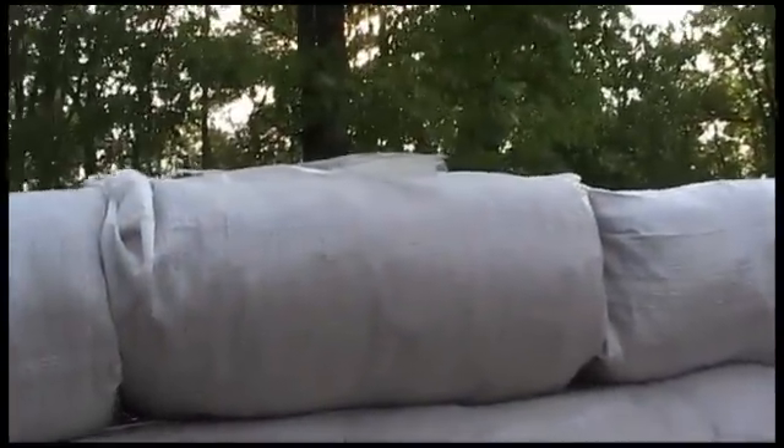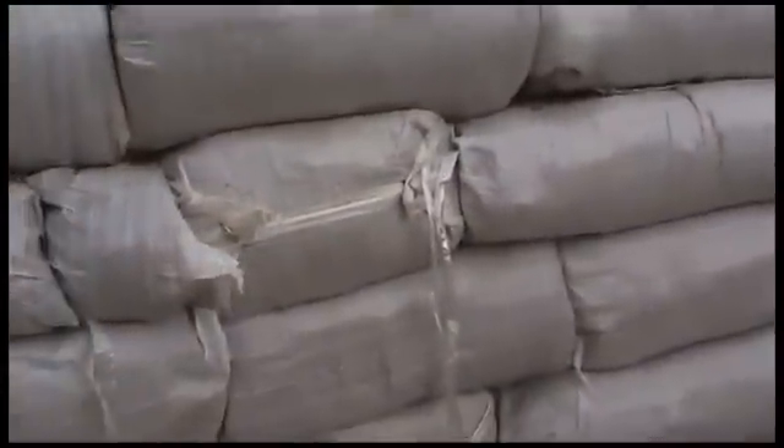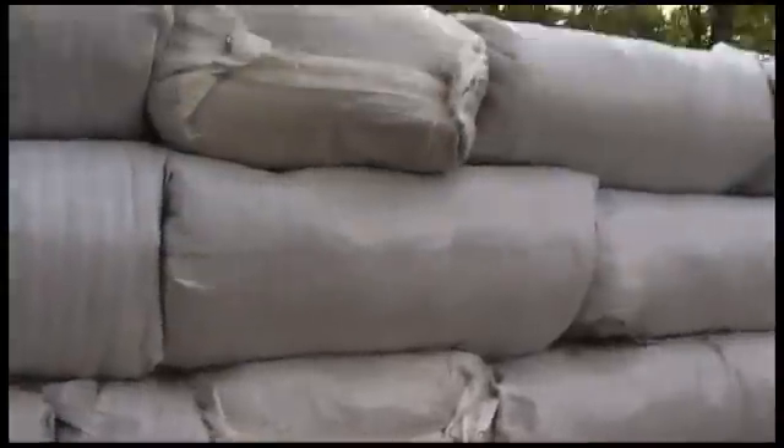These are polypropylene sacks filled with sand and clay that's moist, and then we pound the crap out of it. Between each row are two lines of barbed wire, and the barbed wire acts like velcro. If you've ever had barbed wire catch onto your clothes, you know what that's like. It does the same thing with the sacks, so when you're trying to get these sacks off it's actually pretty difficult — it gives tensile strength, lateral strength, so you can't just push the bags and make them slide off.